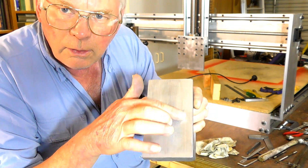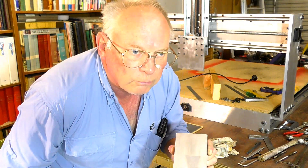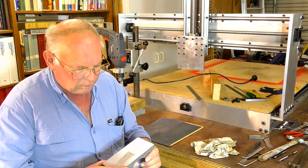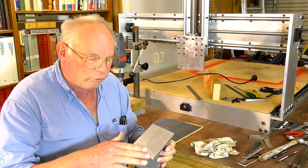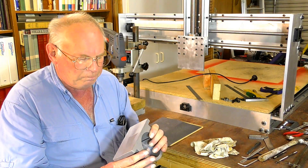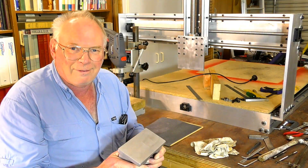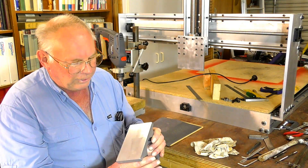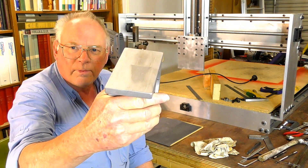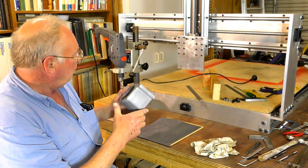But the centre there has not been machined. That is because I would suspect the big mill or whatever was used to surface this was out of tram. You can see the result. But now I know this is going to be nice and square on here.